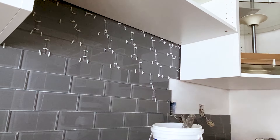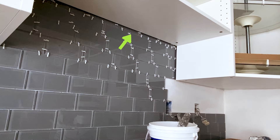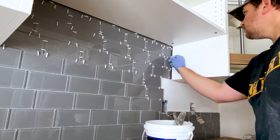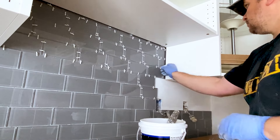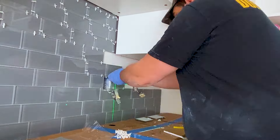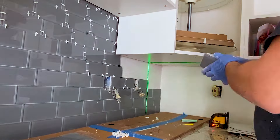At the very top row, in an effort to minimize the number of tiles, we cut them in half and snuck the half tiles behind the sink cabinet. We finished up the top 3.5 rows first to make sure that we had easy access to the space behind the cabinet to the right. With the area above the sink complete, we moved on to cutting out the rest of the tiles for this wall and installing them carefully around the wall outlets.